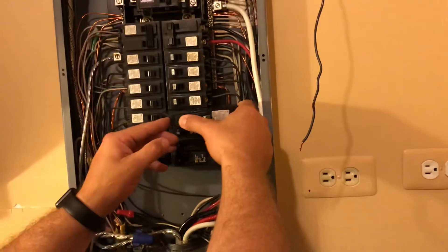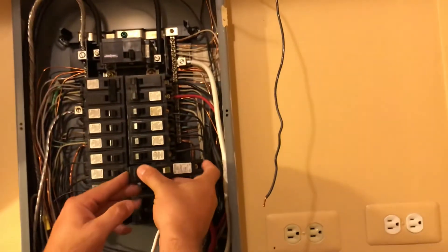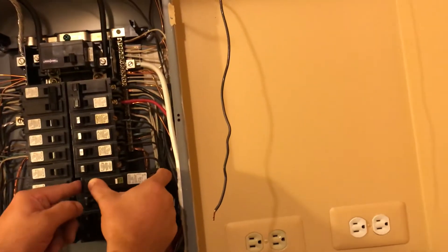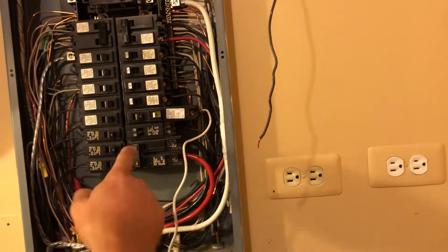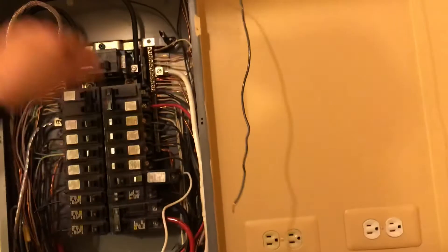With a little time and patience, you can make things happen. You may have to make some room in here from some of the wires already in the panel, because this thing takes up quite a bit of room. What you want to do is pop this into place, and you may have to wiggle it around and finagle it to get it in there. Get that into place — it's already seated on the busway. Make sure that it's off unless you shut your main off, then proceed on taking this pigtail up to your neutral bar. This wire goes down to that silver screw I showed you, and then this lands on the hot part of it, and you can re-energize your circuit, and that's it.